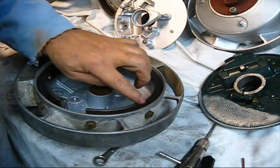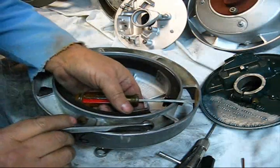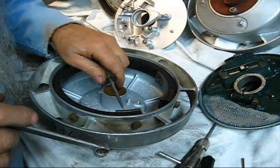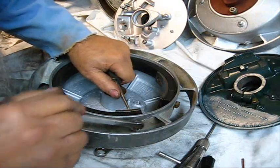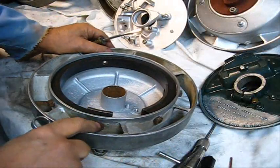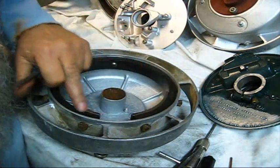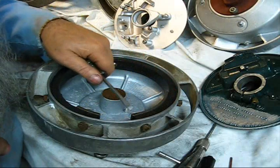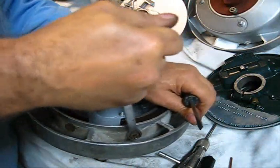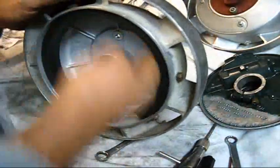You do want to make sure that the shoe can move - I'm going to adjust it. You see, you can move that a little bit. You do want that shoe to line up perfectly with that magnet ring. Tighten her up, but don't twist her off because these are 1936 nuts and bolts. Same way over there - make sure that shoe is in alignment with that magnet ring. That's good, we are done with that installation.